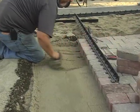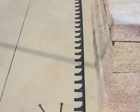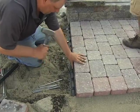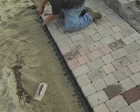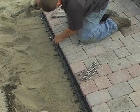Once you've finished laying the pavers, we are going to need to keep the pattern tight with edging. Chicopee Mason Supplies also has plastic and metal edging. Take your edging and with non-galvanized long nails, affix the edging to the side of the pavers. Don't skimp. Make sure the entire edge is covered. And make sure you use nails that will rust. The rust will help keep the nail secure to the ground.